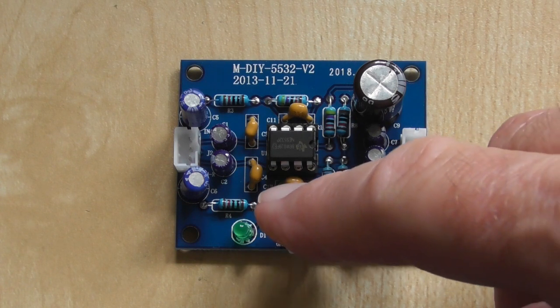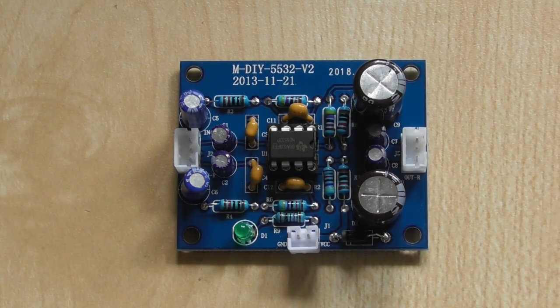But these are the ones that are in the feedback loop, which you don't require unless you do want to limit the frequency response. But 330 picofarad is too high. Incidentally, in case you don't know, they're actually labelled 331, which is in fact 330 picofarad.